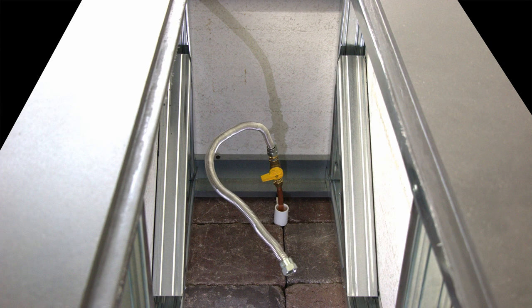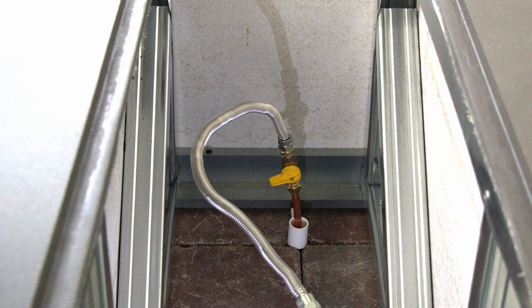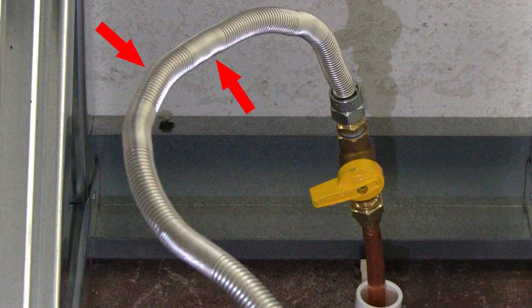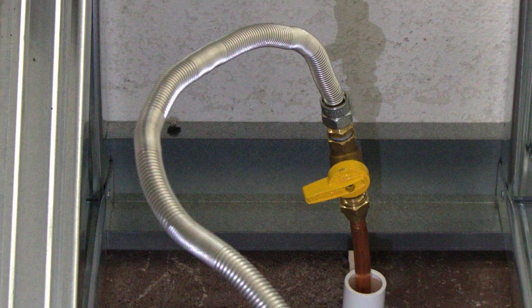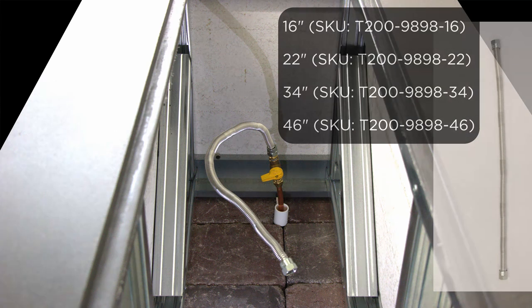For ease of making gas connections, you should use a noise-reducing flex with half-inch flare fittings on both sides to connect your gas line to the burner valve. Notice the noise-reducing flex has staggered coils that break up the harmonics of the gas flowing through the flex. You risk a loud flow of gas or whistle by not using this flex line. You can order these in various sizes at outdoorrooms.com.